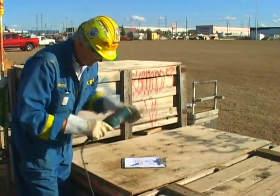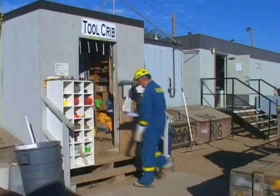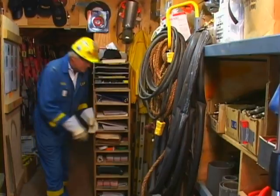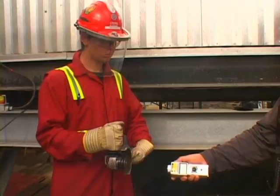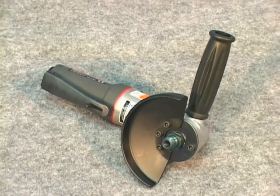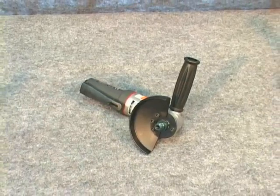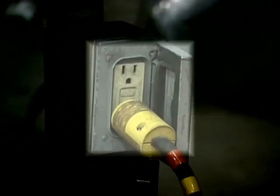Your company may require monthly documented inspections of abrasive portable grinders, requiring a designated competent person to complete the inspections. The grinder's speed or RPM should be checked as per the manufacturer's specifications during regular scheduled maintenance or repair. Air or pneumatic grinders require an inspection and RPM check once a week or every 20 hours of service. But most importantly, before each use, the grinder disc and various components must all be inspected by the operator.